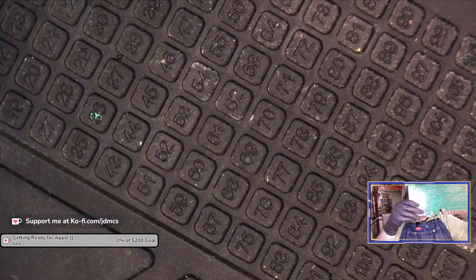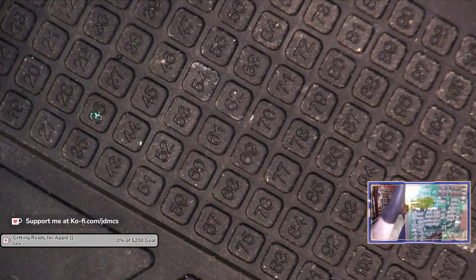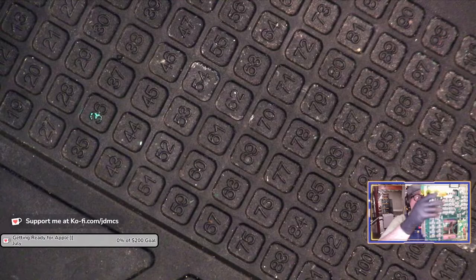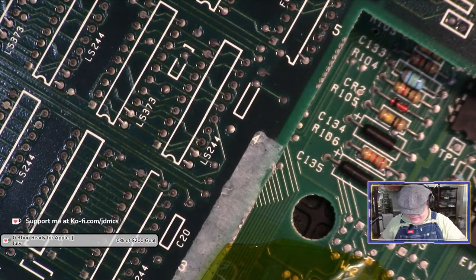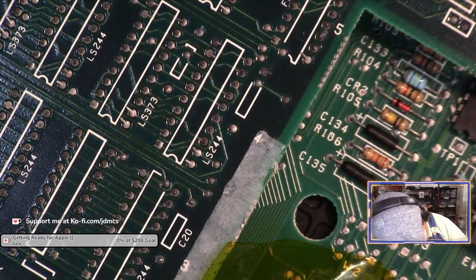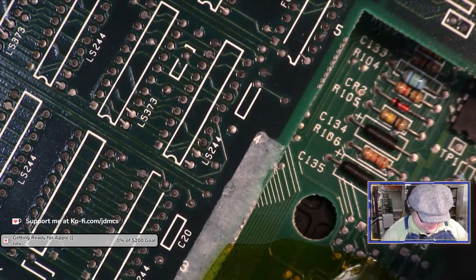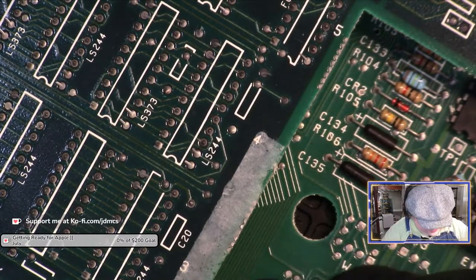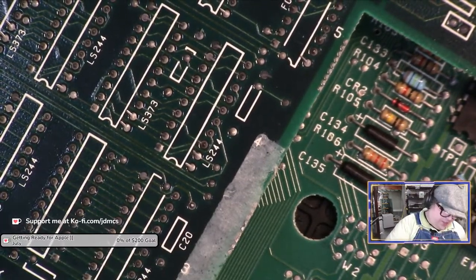Ah, and it's actually the two that looked fine, but aren't. Let me see which side is better for removing that solder. Actually, I bet those are clear enough to put the new socket in place right now. Yeah, look at that. Just enough solder to keep the chip from coming out, but not enough to prevent the socket from going in. The other nice thing about using this wide Kapton tape is I can reuse it. It's now my IC socket holder.